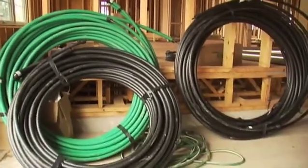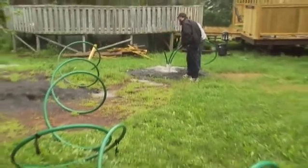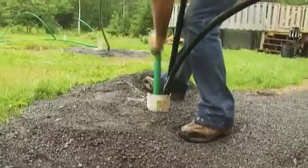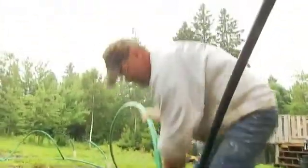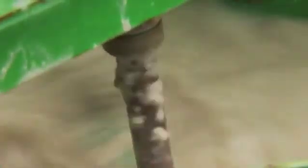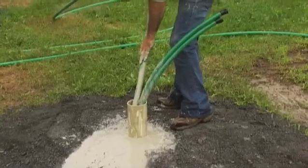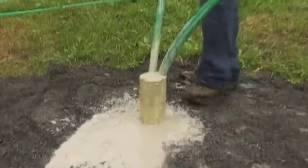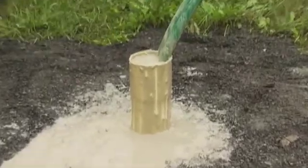If you could take a piece of land, put special pipe in the ground, and it would absorb enough natural gas to run your furnace all winter, you'd be out there with the excavator right away. Well, geothermal is the same thing. We can absorb heat energy from the ground and concentrate it enough to heat your house for the rest of your life at a quarter of the cost. And it's renewable energy — we're not producing greenhouse gas emissions in near the quantities you would burning oil or electric heat. Running at one quarter the cost means producing only one quarter of the emissions as well.